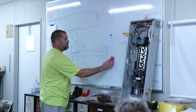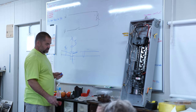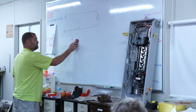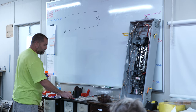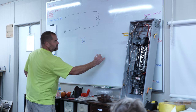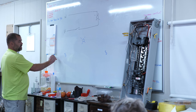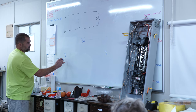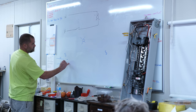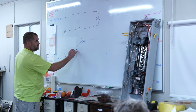One other variation: before current code, especially in older buildings, there was a wiring method where all six wires — from both switch boxes — were pulled up to the light box. The neutrals tie together, the switched hots go to the light. In the 14-2 cable, the black and white make sense as described. But the result is a black and white going to the light and a black and white connecting to each other, which can look like a complete mess — especially if a maintenance person has already been in there and pulled things apart trying to figure it out. So you may have that in your home.